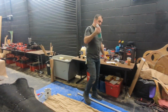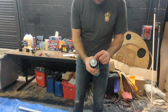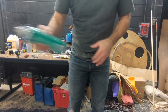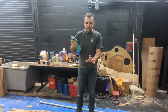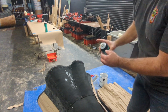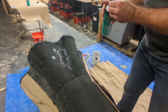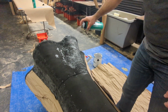So you've also got a choice on top of the can for a lot of spray glues for a small, medium, high fan. So I think the H is high, so we'll turn the nozzle over to H, and we'll just make sure that we're getting a 4, 5, 6 inch wide fan of glue, which you can probably see best over here. So that's narrow, so I had it backwards, it's over here. Maybe not, it just takes a minute sometimes to get it, there it is. See, we got a nice big wide fan coming out now.